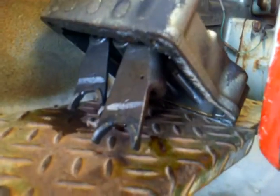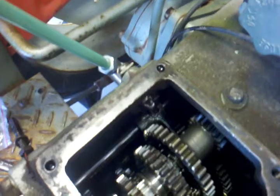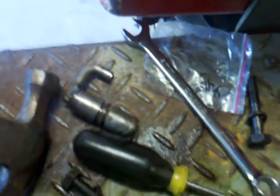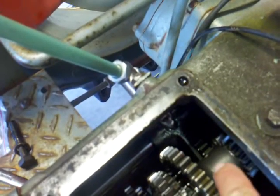Here we are, the Yanmar YM2000. I got the gearbox pulled off the top here of the shifter box. Had to replace the high-low range selector which was there — ended up having to use a hacksaw and cut it off where the bolt went through right here to make it shorter so that it would drive out past this part here. The issue is it wasn't taking and going in or staying in high gear, and before I get to using it much I wanted to find out what's going on.